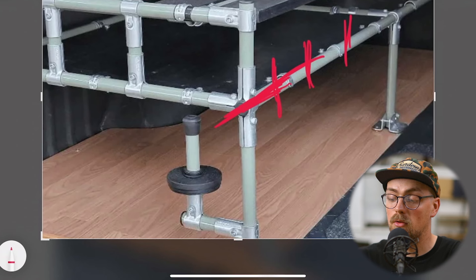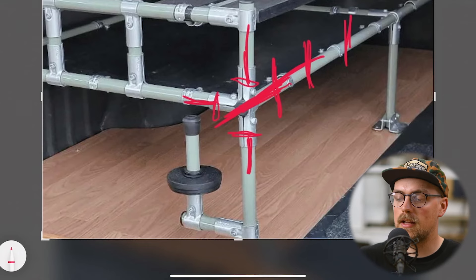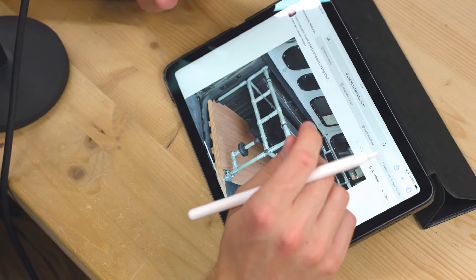And then there are three other pieces of conduit that terminate inside of the connector — they kind of stop inside there. You don't have to do any drilling whenever you're building with Maker Pipe connectors. It's all clamp-based and it relies on friction. So that's something to keep in mind if you're building something.